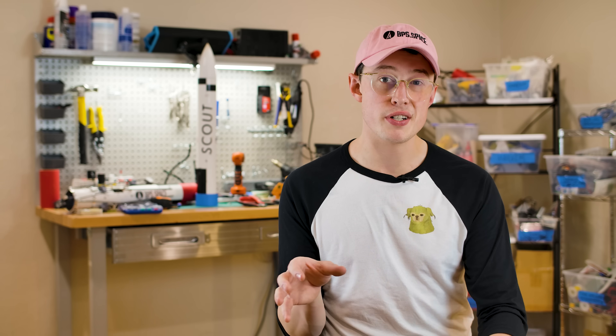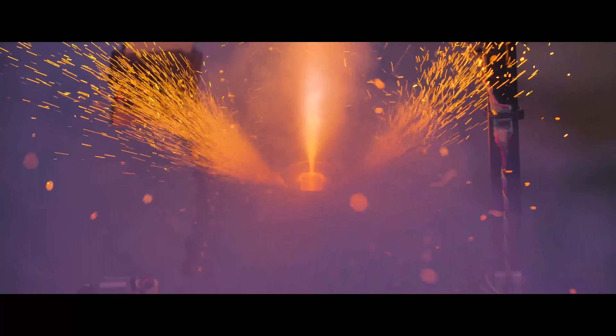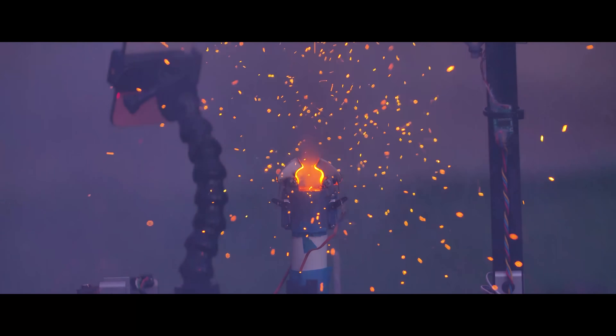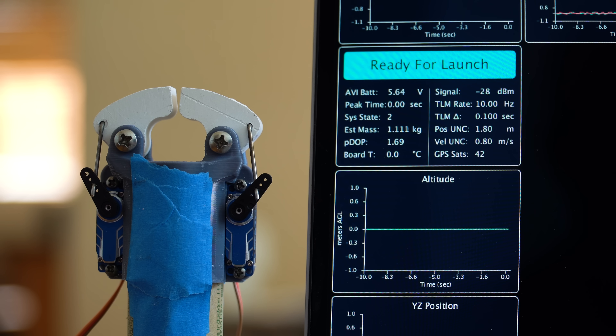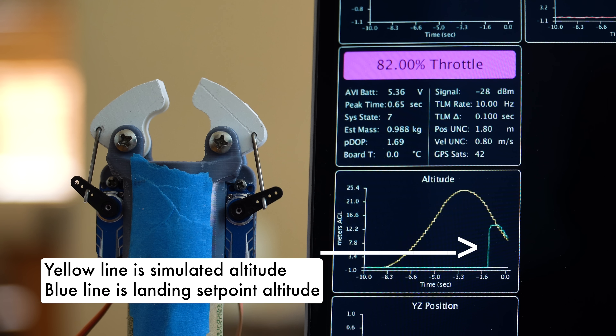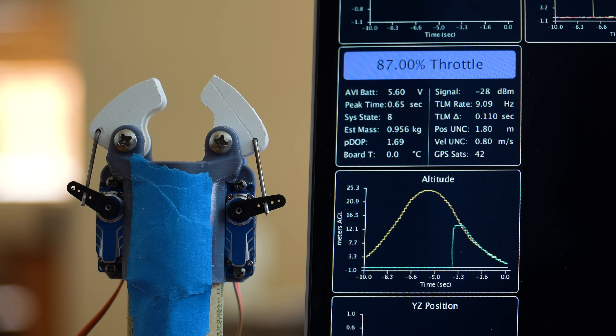Because we only reached 18 and a half meters, this breaks how the landing approach is supposed to work. We do have the ability to control the throttle of the landing motor, but only to a point — you can't have infinite throttle ability. It's also a solid rocket motor, so we're working with more constraints than just thrust: we have a fixed amount of burn time. One of the constraints is that we can't land from just any arbitrary altitude. We have to work within our expected flight profile. The landing approach ideally would let us land from 25 meters plus or minus maybe 3 meters. We generate set points on the way down of the expected altitude that we should be at if we drop from 25 meters, light the landing motor at an ideal place, and then plot this altitude curve on the way down.